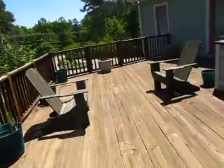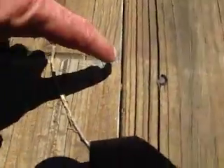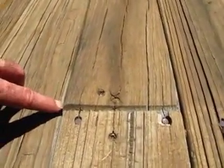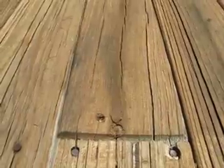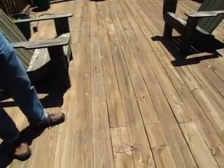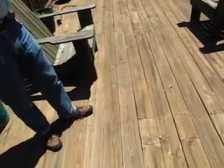Be prepared though that the width of the board will also vary infinitesimally. For example, you see these two guys marrying up real pretty — right here it's even, and right here it's even. So the next time we put a board in, it might be a quarter short. You split an eighth to each side, and you're going to have a little bit different gap. Usually they're shorter left to right, even though it's a five-quarter board — which is a true one inch — and the width is six, which is a true five and a half. These boards are getting thinner and shorter every year.